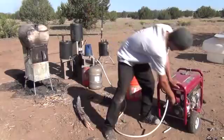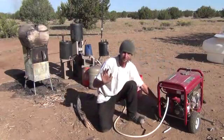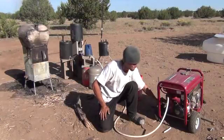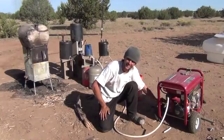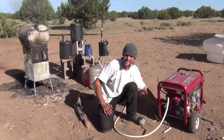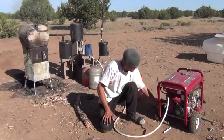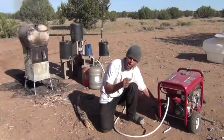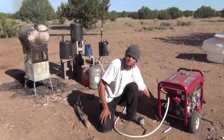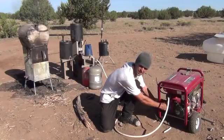We're going to try it out a few more times. And there we go — that is the generator running completely on synthetic gas. I've been at this for a little while this morning to get it right. I had it running like this a little bit ago and I knew I could get it again. That right now is pure synthetic gas, and you can tell as the generator gets going it's starting to run a little bit stronger. I'm slowly moving my finger — there's a little air gap around the hose I just tucked down in there. I'm using my finger right now as a kind of a valve to allow more oxygen in.